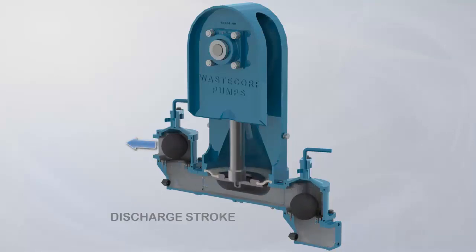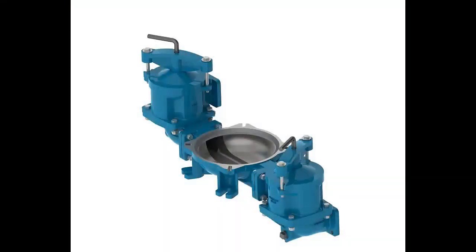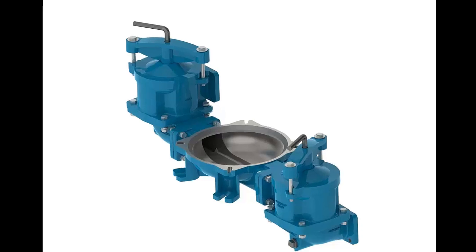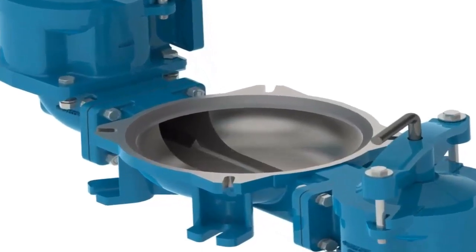Since the stroke length of the trunnion is extended, the pump can transfer large volumes of liquid at moderate speeds of only 10 to 100 RPM, which greatly extends component life and increases durability. The unique design of the SludgePro ensures that the disc never contacts the pump body. Passage of large solids and grit travel along the contoured velocity channel which is integrated into the pump body housing.